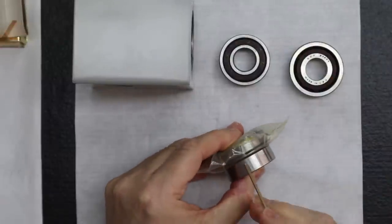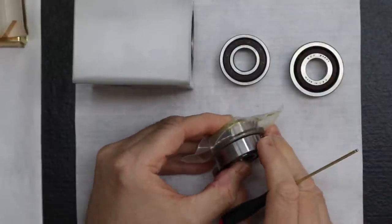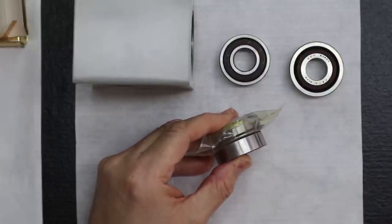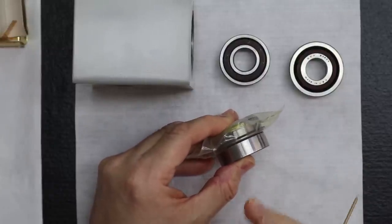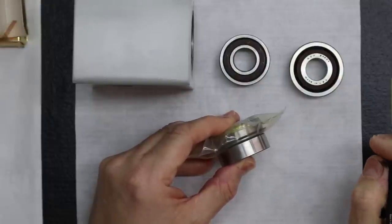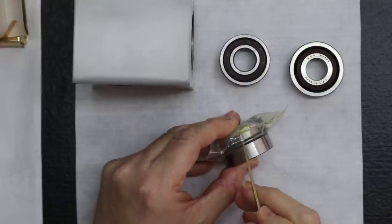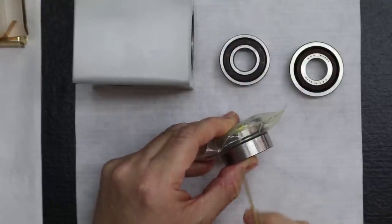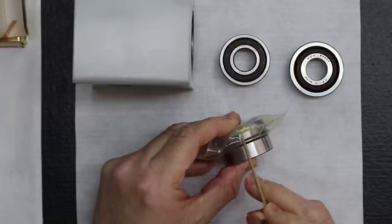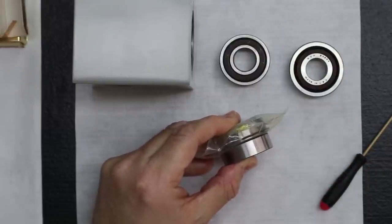We machined that groove right there, and again, we want to reiterate, we used a hardened precision instrument lathe. Yes, very critical. We can't use one of those import lathes here, and you had to have that six jaw chuck for that very reason. Look at the depth of that cut we had to make to get that ring in there. Very deep, and this is very hard. So it's really aggressive. Yeah, and this groove has to be precisely cut. That's why you need that larger lathe for the rigidity.